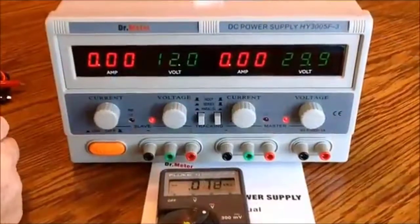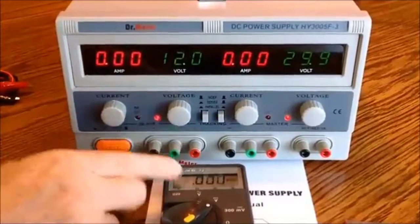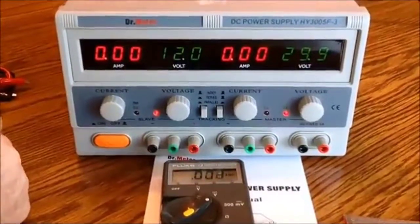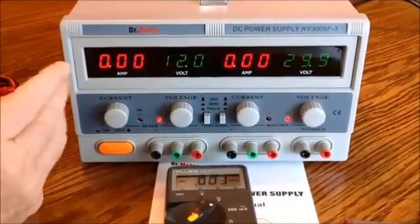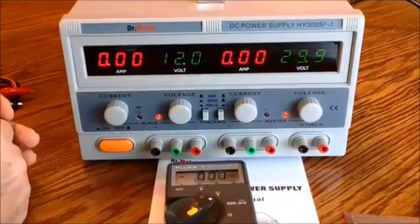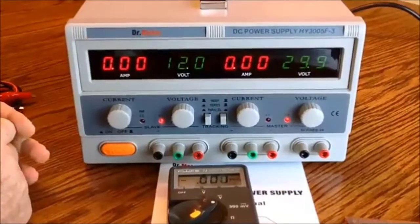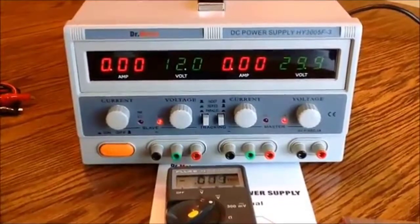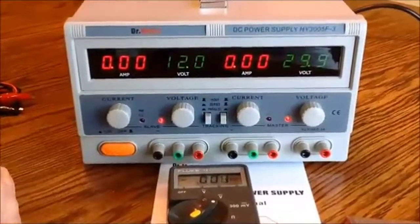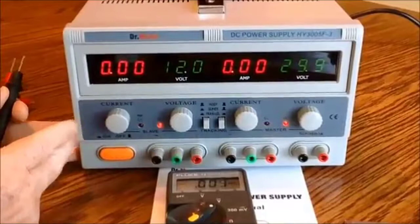I don't have my oscilloscope anymore — I didn't use it very much so I gave it away. I'm going to use a Fluke multimeter to check the voltage outputs and show you how accurately they can be set. Because I don't have an oscilloscope, I asked the supplier how the unit was tested. They sent me about a 40-page document including test procedures and photographs of how this unit is tested in the lab, and it's impressive. They do things like voltage regulation, harmonic current testing, high pot testing, and electrostatic discharge testing. From what I can see, this thing is well designed and very solid.